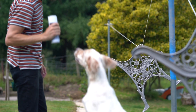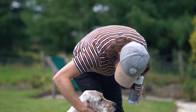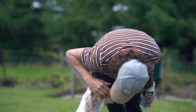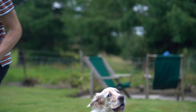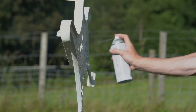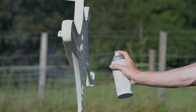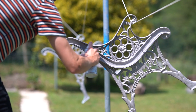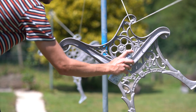It's also going to fill in any small indentations that it's had through age. Ideally you want to be doing this on a nice warm day — it's really going to help prevent the orange peel effect that you can sometimes get. But if it is cold outside, feel free to leave them in a warm place and then bring them out when you need to use them. I'm just doing a nice even left-to-right motion, probably about 15–20 centimetres away from the actual bench ends.